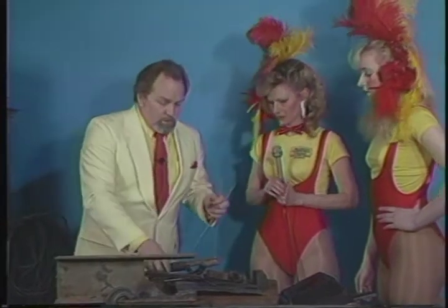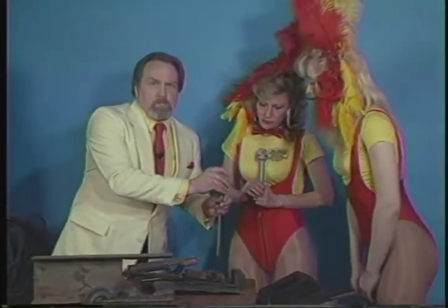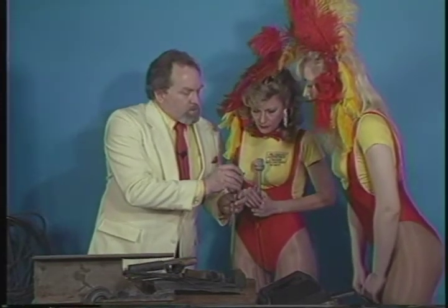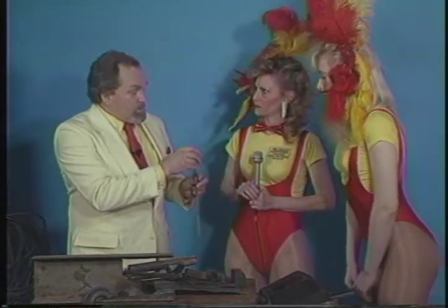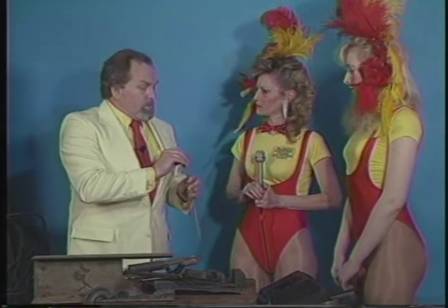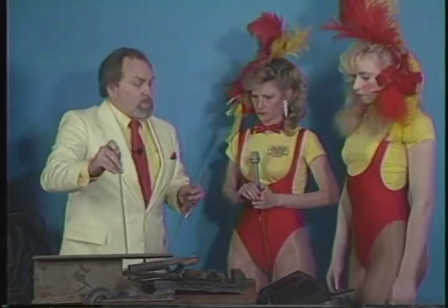So what happens is you see how this burns in like that, and if you look on the inside, and Chuck, don't even try for this because I don't think we can get this at all, but I'll show the girls. You see how there's like little sparkles in there? That's all the little iron powder in there, and that will carry a little electricity, so that you don't have to actually stick the filler steel, actually make an electrical contact with it.